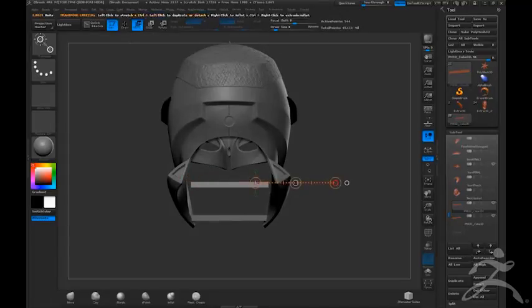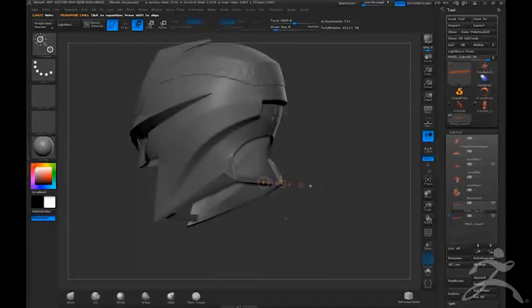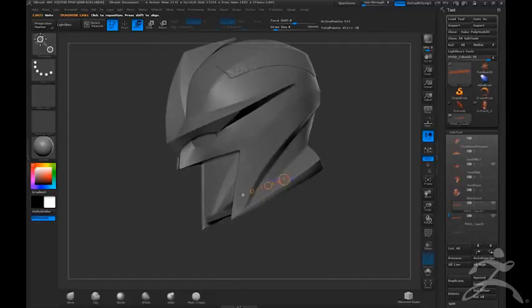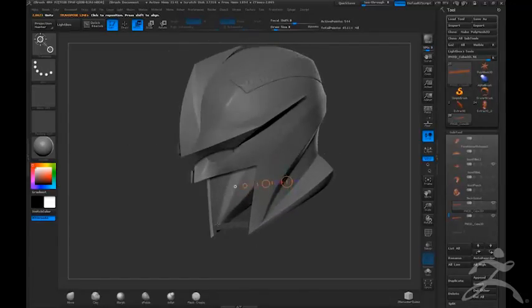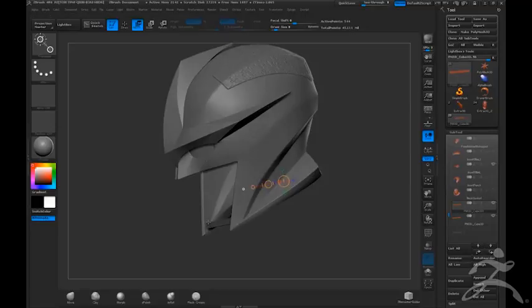And pull this out. Move this up. Now, the reason I'm going in and pulling this away, at least a 1/4 to a 1/2 inch away from this leading edge, is because if they're just going to cut this off and use the actual helmet as is, go ahead and paint it, then it's not that big of a deal. You don't want it getting close to that edge, so they don't have to worry about having to do any edge repair physically. They can go in and just snap this off, cut it off, and sand this down flush.